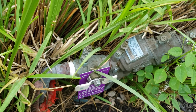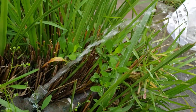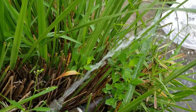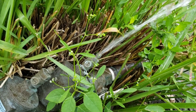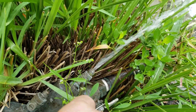Look at this — it's just trickling out across this backflow. They've got a tankless water heater and it's not working properly because there's not enough flow. We're going to get them squared away. I'll get this thing taken out and then come back and put that Wilkins 700 in here.